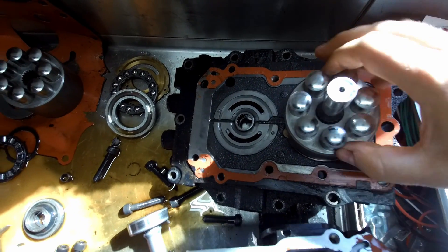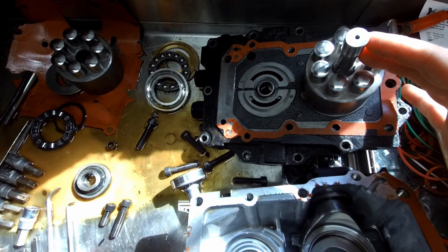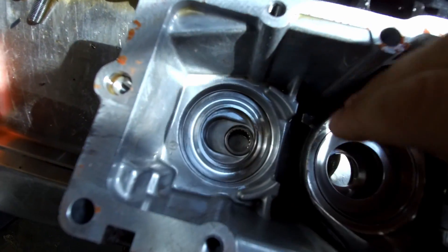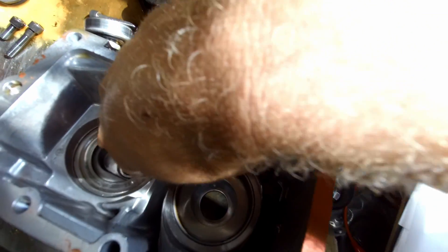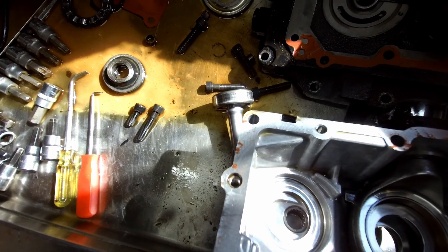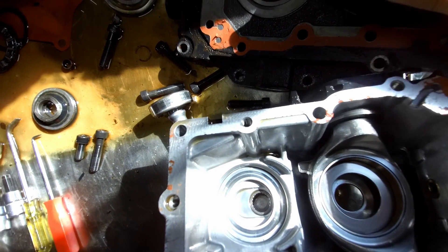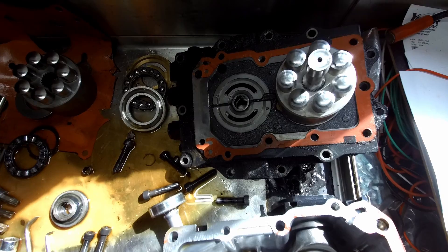You can open them up and see they have a spring inside, just like the pump. It is also coupled to a shaft — this is your output shaft that goes to the rest of your transmission or gearbox. The drive motor side has a fixed angle permanently mounted into the case. That is not a neutral position — it's a set angle; instead of a swash plate, it's a fixed angle plate. If there is no flow, this does not move. If there is flow coming into the drive motor, it will force it to turn in one direction or the other depending on the direction of flow, and it will turn for as long as there is flow. As flow increases, the speed it turns will also increase.